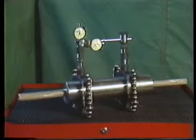The test fixture for measuring bar sag can be an old shaft, a piece of pipe, or a piece of round stock. However, it should be large enough in diameter to prevent flexing that could cause erroneous sag measurements. The dial indicators and brackets have been attached to the fixture, making sure the height and distance between the brackets are the same as they were when mounted on the shafts.